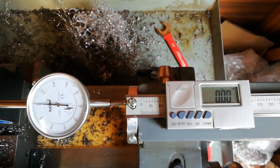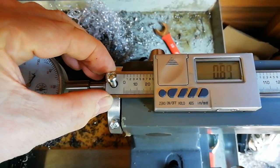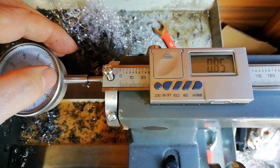But there is a problem. The bolt there is an M5 bolt and its external diameter is about 4.74mm. And the closest drill I had was a 5mm drill, which means there's some play — about 0.3mm. As I say it doesn't really matter, but it bothered me and I wanted to get rid of it. So here's what I came up with.